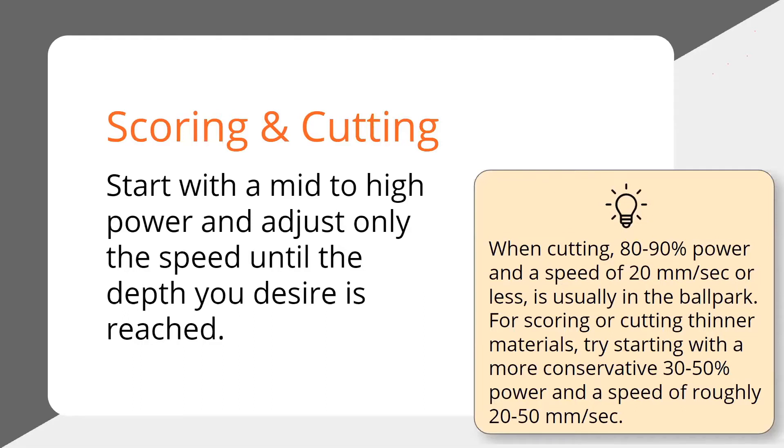I know there's a lot of information out there that says don't laser at 100% power, but that's for people that bought lasers that aren't dialed in properly — where the laser is not set up to limit you from causing harm to the laser tube. We take care of that for you. So even at 100% power, you're not going to go beyond the manufacturer's recommended amperage for that laser tube. Between 80 and 100%, there really isn't a big difference — if something's not cutting at 80, it's probably not going to cut at 100. Most of the power in these laser tubes is at the bottom end, in the 30 to 50% range. Think of it like a muscle car that has a lot of torque when you first step on the gas, but at the high end it's really unimpressive. So for cutting, set it to 80–90% and use all that power, then adjust your speed.